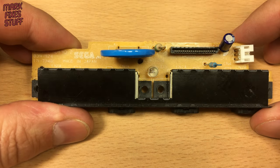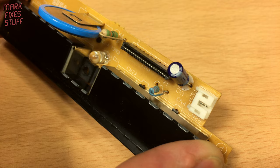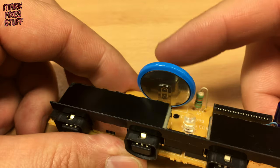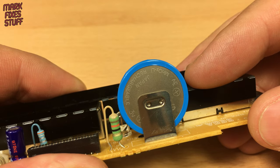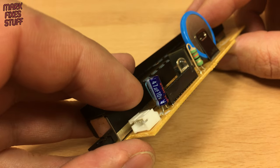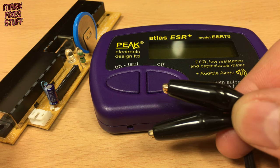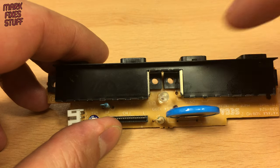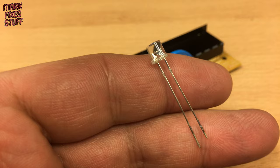There are four areas of interest on the board. This fuse, which is a one-time one-shot deal — if it blows you have no controller port power and a useless console. This fixed battery: all of these have long died, leaving consoles begging for time and date input on power on. This 47 microfarad 10 volt capacitor — it's probably fine, but it's a 20-year-old electrolytic so we'll replace it anyway; we'll test the old one after removal to see how well it held up over the decades. And the power LED — the standard LED is amber, but this can be changed. We'll be using this green LED so you can see the process of swapping them out.